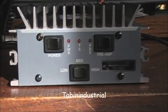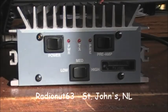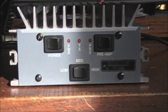Hello everyone. Today I decided to do a video on my Elite Line TX2250, it's a linear amplifier. I recently had it in St. John's whereby we had the relays replaced, and that somewhat managed to fix some of the problem. But right now what's happening is once the unit is powered up, it is automatically engaged — the TX light automatically comes on.